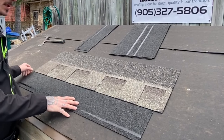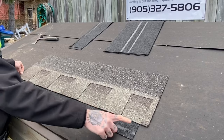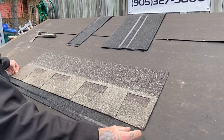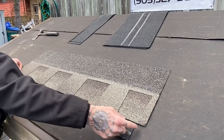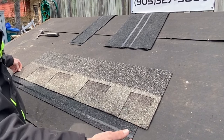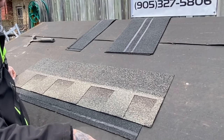When you go to start the installation of your starter shingle, be sure to notice that your actual shingle length is approximately the same — it's about an inch difference. But if you start with a full starter strip shingle, these are eventually going to line up: your water lines will match up, and that's going to cause a leak right at the eave of your roof, and that's definitely something you don't want.